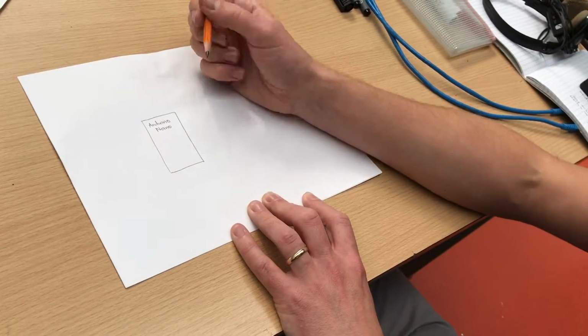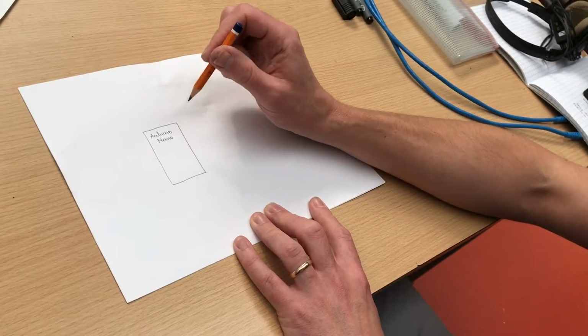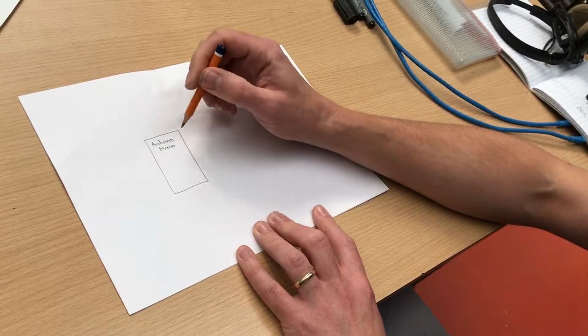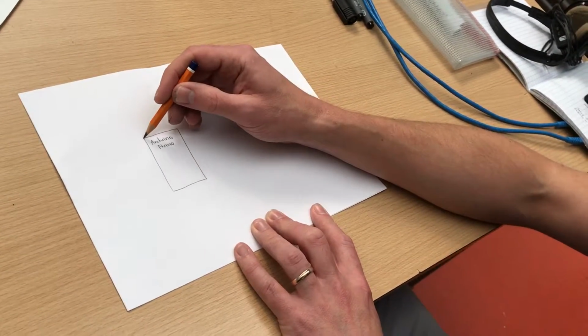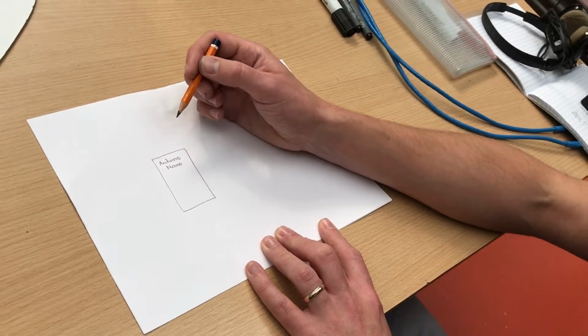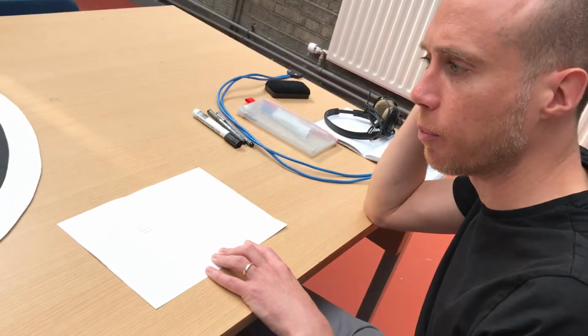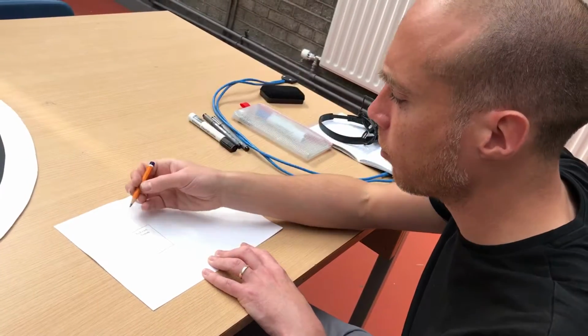And in order to run the Arduino, the first thing we're going to need to do is to connect some power. Now, nominally, I think you can connect a voltage source to the unregulated voltage input. So typically people will connect like a 9-volt battery. I think 7 volts might be the minimum there, or something like that.